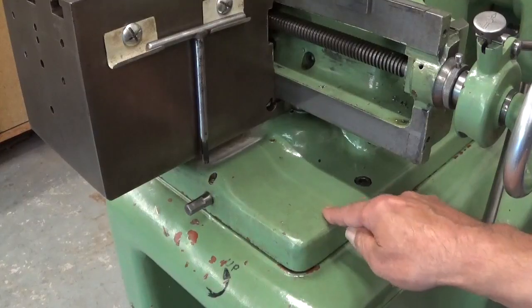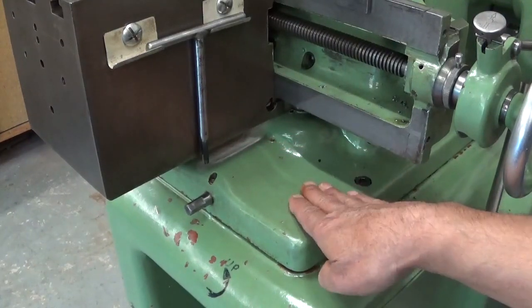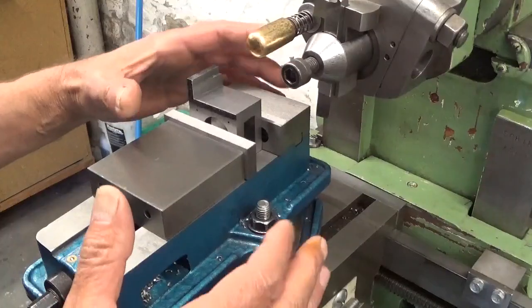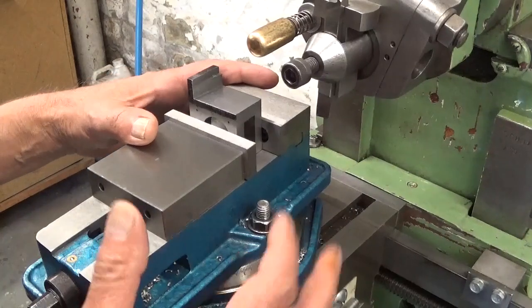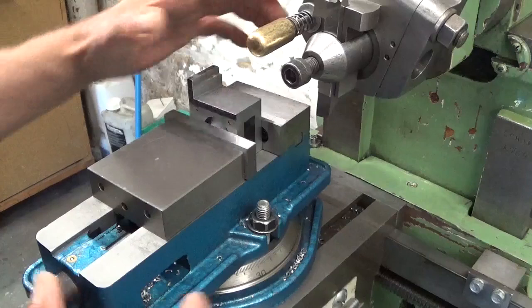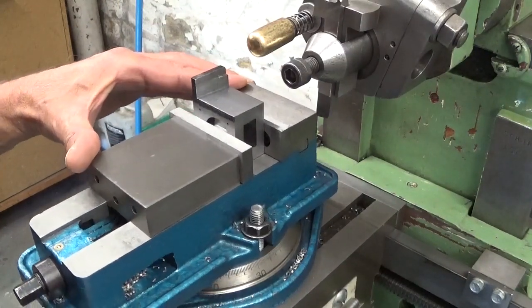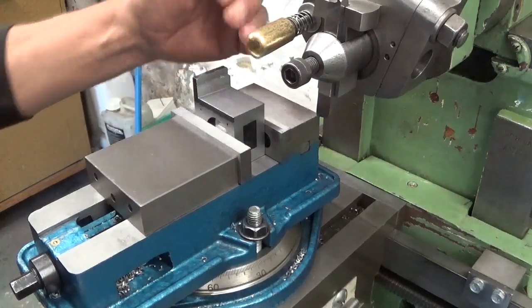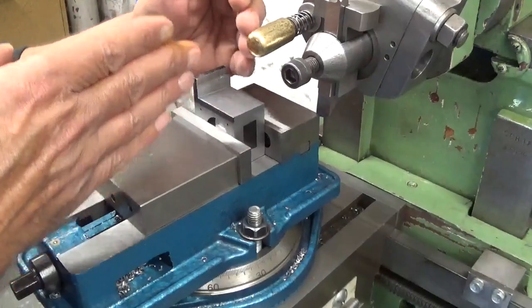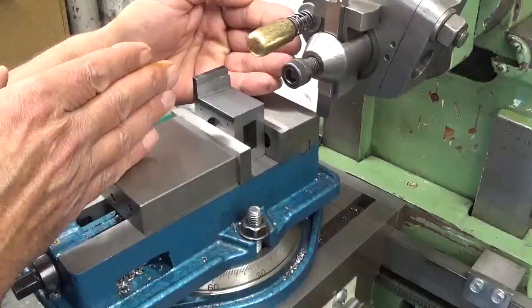First I said that making this bump is impossible with the machines I have, but in fact it is possible. I installed the swivel base at 5 degrees, which leaves me here now a little triangle. So now all I have to do is set 5 degrees the other side, and I will have the bump. It will be pointy, but after a touch with a file it might look like something.